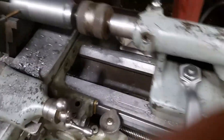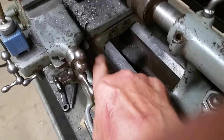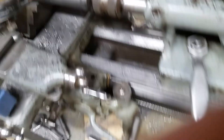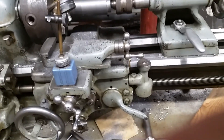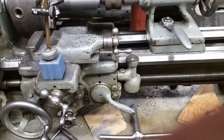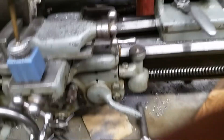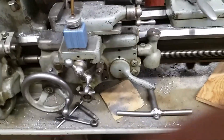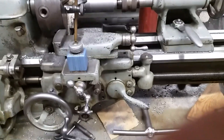I'm going to stick this in partway through my series here on this lathe. I actually went and found the part number for the carriage lock on a website dedicated to South Bend lathes from Practical Machinist. Once I had the part number from the parts catalog, I was able to go on that auction website and for $25 including shipping I got the lock for the bottom. So that part is taken care of - thank you to everybody for keeping old documentation around.